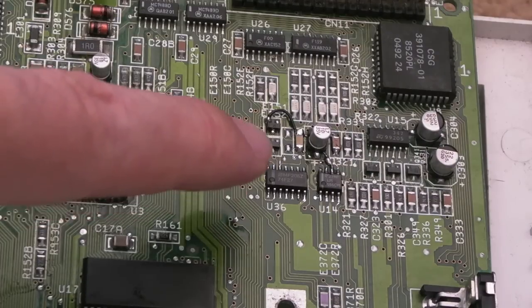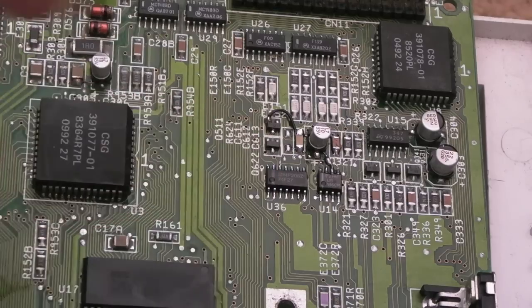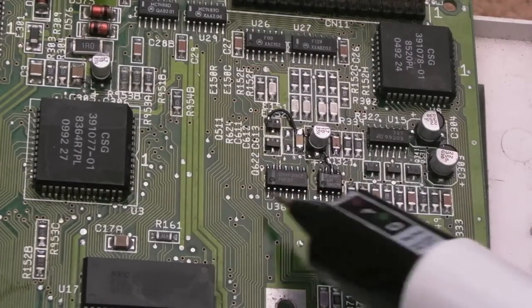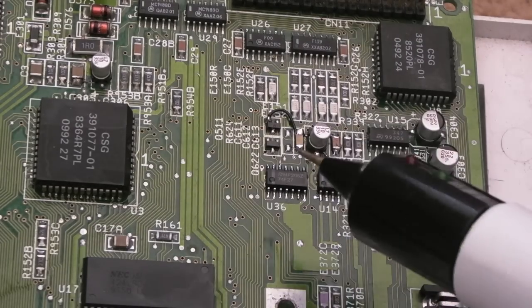The interesting thing is it was frozen on a black screen, stuck in reset without this little chip. So that was a valuable test. The fact when we removed this, it was still behaving just the same. And the issues we saw with the whole keyboard reset thing, you know, the keys being triggered when the thing wasn't on and all that, you know, I hadn't actually booted.